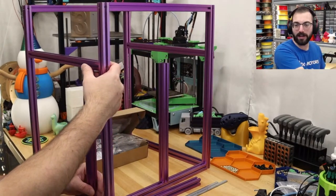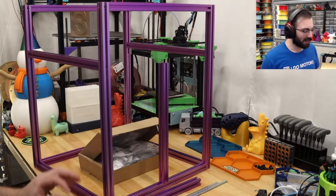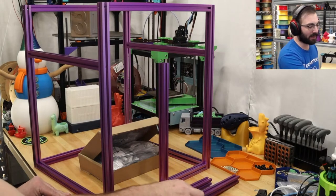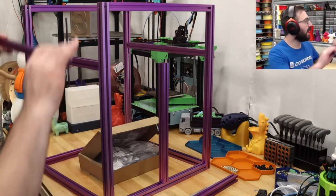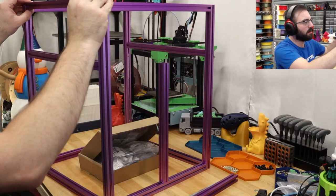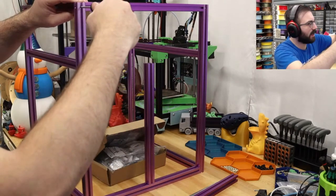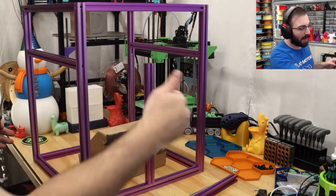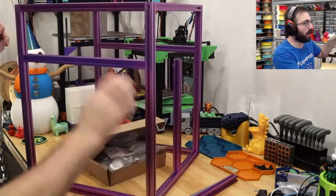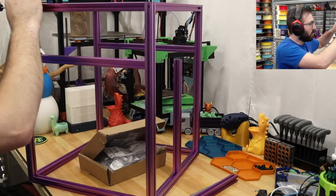You've had to flip your 350 2.4 one too many times. Yep. It's not fun because on a 2.4, you can't access electronics by removing the bed because the bed is fixed. So you have to physically flip it out. I think there's a drawer mod, which sounds intriguing, but again, the nicest mod I've seen is the side pack mod. So all your stuff is still accessible, but you can access the printer and the electronics at the same time. The Rat Rig is also cool because electronics are in the back, but you still have to reach around to the back. Especially if you have the really big one, it can take a little bit of time.